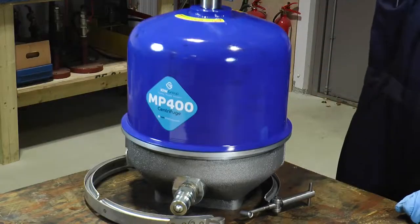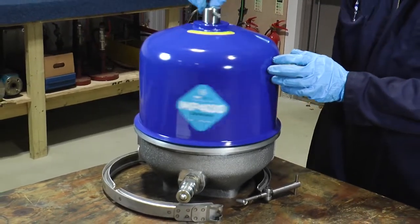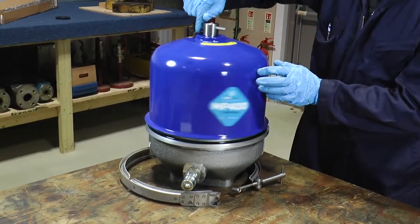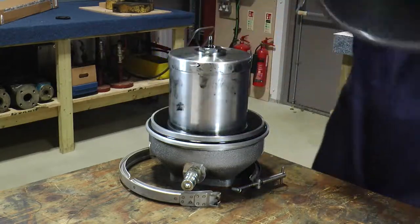The second thing to do is to remove the cover assembly. Because we have a left-hand thread, spin the cover assembly in a clockwise direction. When you hear a noise, the cover assembly will be ready to take off.